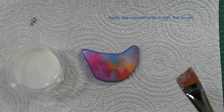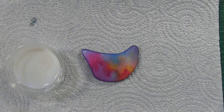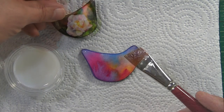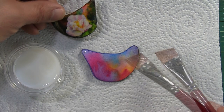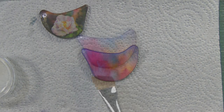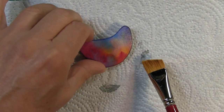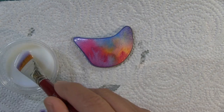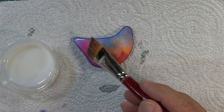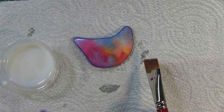Let it dry completely. Once it's dry, you're in good shape — you can build up as many layers as you want, you can brush it freely. And ultimately look at the surfaces you could achieve. That's my personal preference. You don't have to go that glossy — two or three coats can be enough. I'll let that dry. Now that it's totally dry, I can give it a second coat. You can see it even has a little bit of a shine to it. I dip my flat brush into the Polycrylic and I can brush it on. There is no danger of smearing the watercolor underneath now that it's protected under a layer of dry varnish.